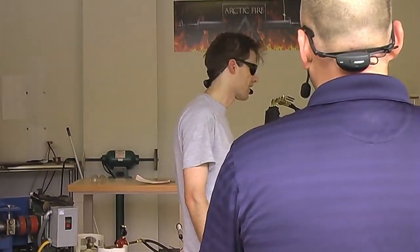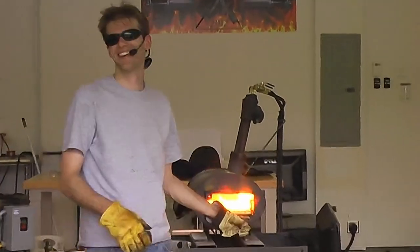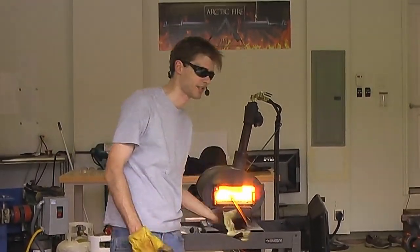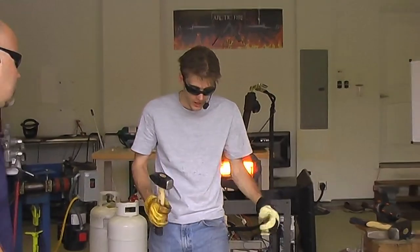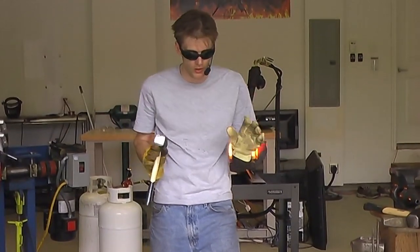So what's happening is traditionally, if you're not cheating and using a press and a power hammer. I don't know why we're not cheating with a power hammer, but okay, I'm in. Well, you are my power hammer. They would have strikers where the master would basically hold the piece, and he would hold the hammer, and he would basically say, okay, well, I know where I need to move material. I need to move material here. And then I strike in that spot, and then the striker will strike where I strike, but they're actually the ones doing the work and moving the material in that direction.